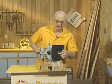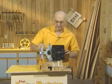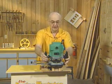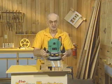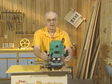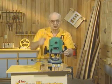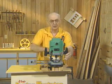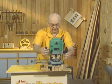But what we have is a depth setup in it. So I've got a fence on it, and that's the portable fence, and what it'll simply do is fit along the outside. And then when you come up here, I'm going to plunge down. I'm going to plunge that down in its location and then push away here. The reason I have to push away is because of the rotation of the bit. Now, once we get one cut in it, then I can rotate it over and do the next one, and that's what we're going to start off with.